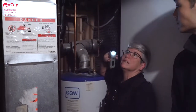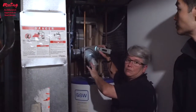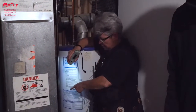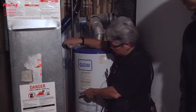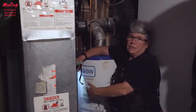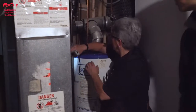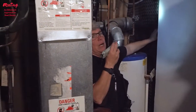With the age of the house, you have more potential for deterioration if things get wet. You'll see some water damage in this area below the plumbing, which is very typical. They've replaced some of the drain pipe with new black ABS pipe — that's the material used today. It'll last a long time. Originally they built with copper drain pipe, also very sturdy. At the bottom you can see the original copper drain piping, which is fine.